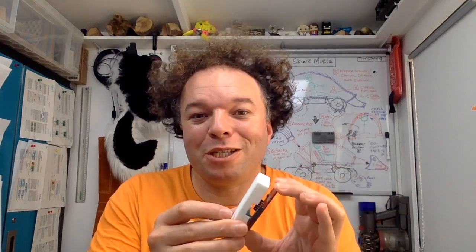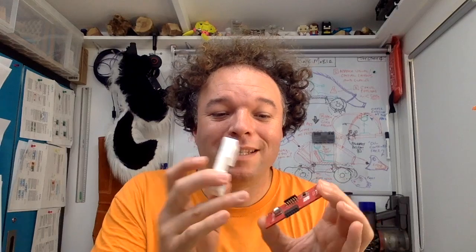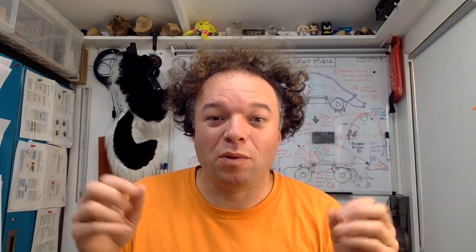It's worth pointing out that I've actually seen rings and all sorts of products where this is just completely exposed to the air. I wouldn't say that that is criminal and an absolutely terrible thing, but it is somewhat against the advice and the guidance of this. So it might be worth benchmarking something with it exposed to sunlight and all sorts of different things which will skew the readings, and seeing whether that's actually a problem for your application. But if you are trying, as we are, to give an as accurate as possible reading as part of a pollution and environmental sensor development kit, then obviously that's why we were inclined to give it shrouding and protection.